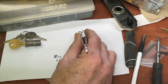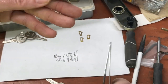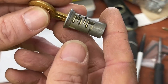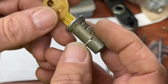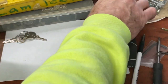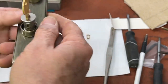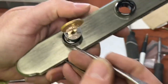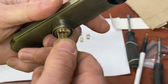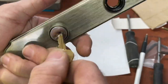It's just a good idea to at least have some wafers you could possibly modify — just a little swipe of a file to knock the point down on the edge. So there we go, that's it on wafer lock re-keying. If you're watching this as a homeowner you would probably have just left that wafer out, since this is more of a privacy-style lock than a real security gate.